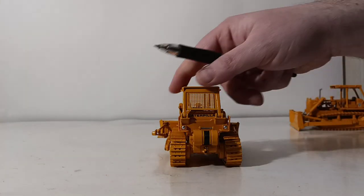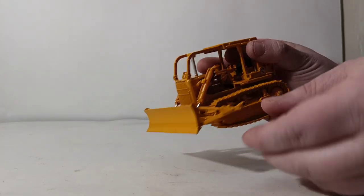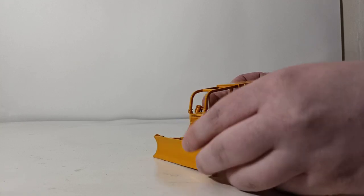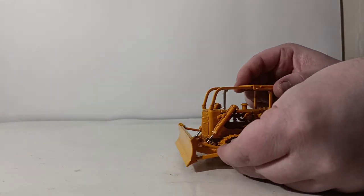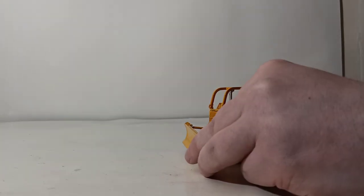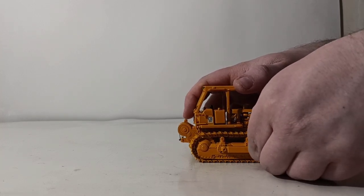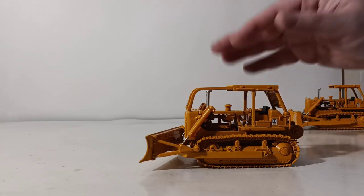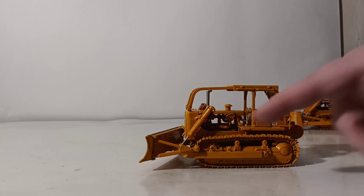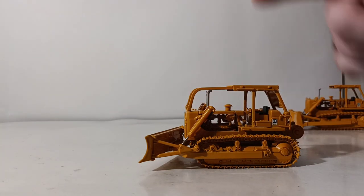It has a winch on the back, and obviously the aforementioned angle blade. Unlike the D8s that we saw recently, the way that you do the angle blade here is a little bit different — it actually has an already inserted pin. These three predetermined holes are where you would insert the pin. Let's take the other side out just like that. Our blade is kind of just dangling, but let's say we want to put it in this first hole on the left-hand side — we just insert it right here. Then we'll put the other side on the furthermost hole, and there you go. Now the blade is angled fully to the right. The system works well, they stay in, and I think it works a lot more effectively than those oversized and flimsy pins we saw before. I'm a huge proponent of this system, and for further releases of dozers that feature A blades, this is what I would like to see moving forward.